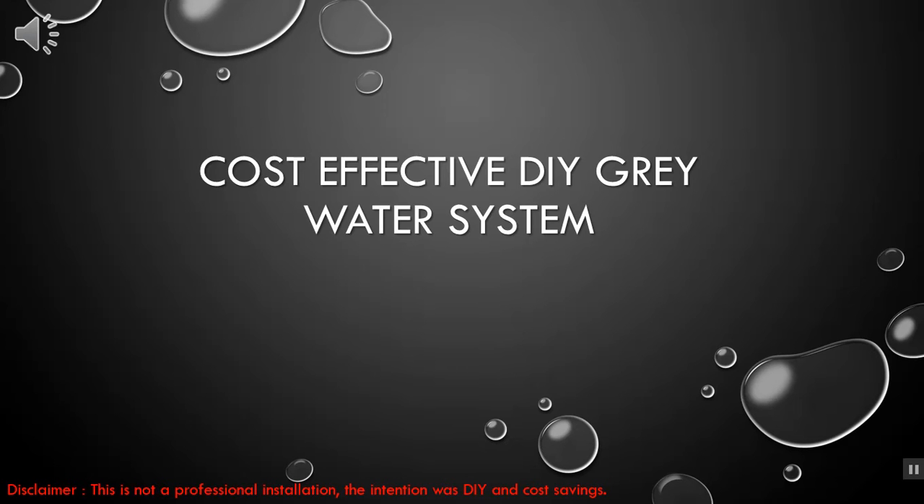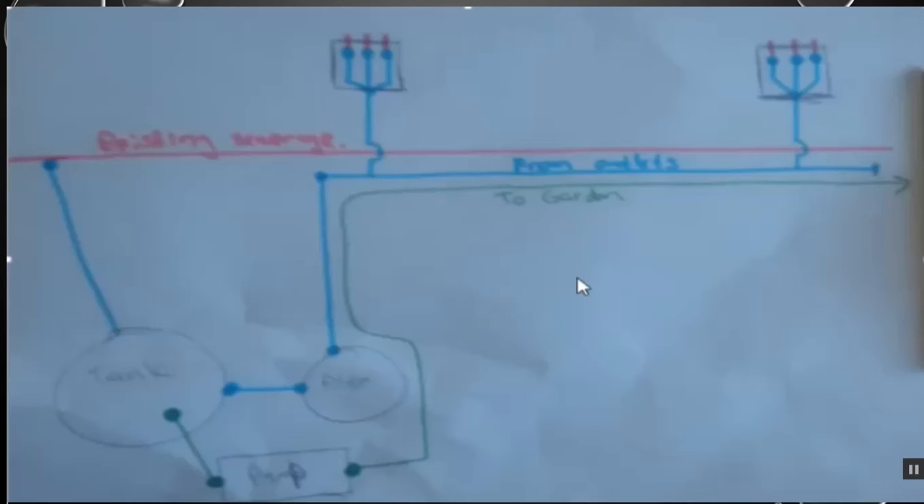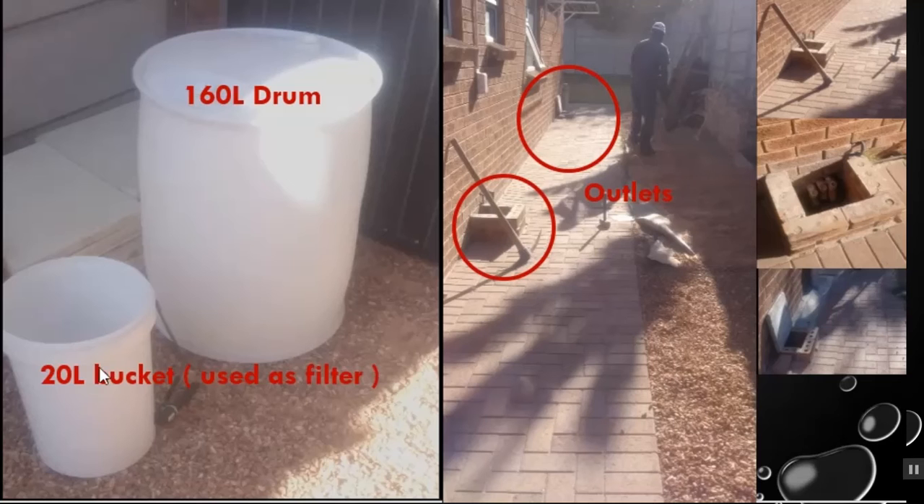To start things off, let's drop a bit of a plan. The red lines are essentially existing pipes — we've got our outlets from the kitchen, the guest bathroom, and another bathroom at the back of the house. The blue are pipes I'll have to put in for the irrigation, and the green lines are going to my irrigation system and the sprinklers. Your outlets run into a main pipe — I've chosen an 80mm pipe — which runs into a filter, from the filter into the tank, and then the overflow plugs back into my existing sewage. The pump would suck from the tank and push out into the sprinkler or irrigation piping.